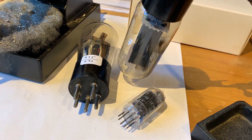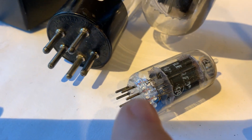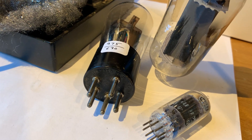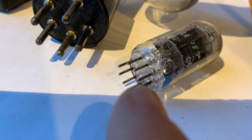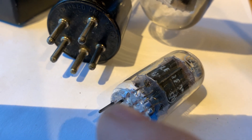And yes, that's the vacuum tube itself. There are two types of vacuum tube pins. If you look at this 12AX7 tube, you see that its pins are not the same as those of a 5U4 or a Type 27. You can also get a KT-120 or any of your power tubes — they have thick pins. So if you see thick pins, that's a completely different thing than those skinny pins. Because these skinny legs are the support rods, the electrodes themselves that travel into the vacuum tube, and you can see those pins go directly into the vacuum tube itself.